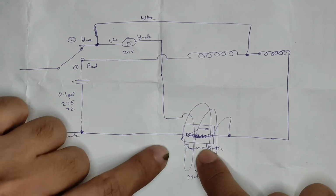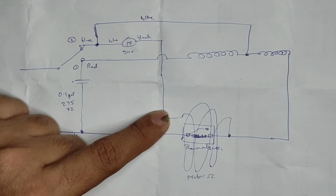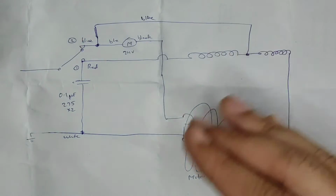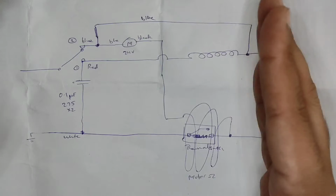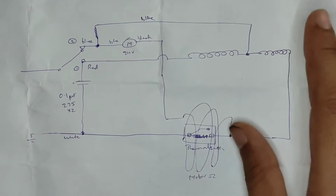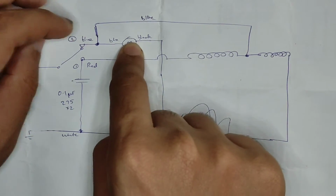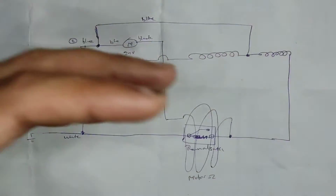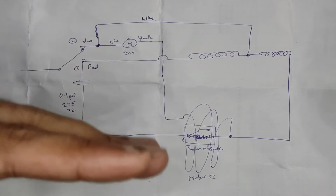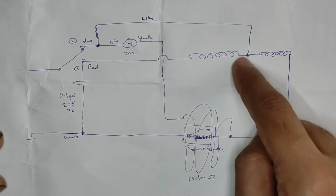So it's interesting that they have placed the thermal cutoff switch right inside the coil for the DC motor. See, the motor is actually the essential thing in here, because if the motor is not spinning up, then within a few seconds the entire set of coils will get burned out because there is nothing to cool it down. The heater is being cooled down every single time by this motor, and that is why the air is getting hot. As soon as it passes through the coil, which is red hot, it takes away the heat from it, and the motor is an essential part to keep the coils at lower temperatures. So if the motor for any reason stops spinning, the temperature gets really hot.